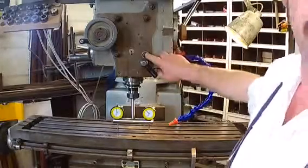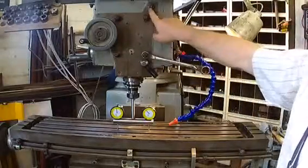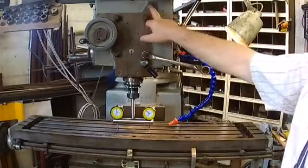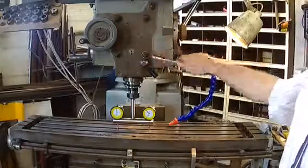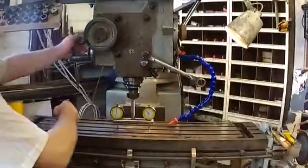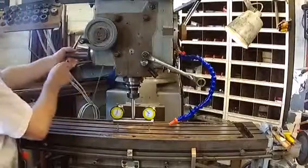On this mill there's four bolts — one, two, three, four — and there's a centre bolt there. If you were going to tilt the mill to say 35 degrees, you'd have to take that one out because that's the fine centre for you. We're slacking them off just a little bit, not too much, and then we can turn the mill. Only here there's a gear in here, and we can turn it whichever way we wanted.